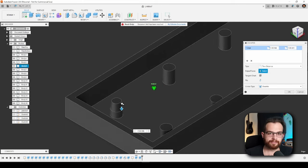Since this keyboard has 18 columns and four rows, I'll need a development board with at least 22 pins. For this project, I've selected a Teensy 2.0 — one of my favorite development boards. I'm going to select a location for the Teensy microcontroller that is least likely to interfere with any of the standoffs, then put down a layer of Kapton tape to keep the Teensy pins from accidentally making contact with any of the keyboard rows. Each of these rows and columns needs to be soldered to a pin on the microcontroller. I'll run these wires as short as possible and make sure they don't interfere with any of the standoffs. Now the keyboard is all wired up — it doesn't work yet because the Teensy doesn't understand it's supposed to be a keyboard, so let's create some firmware.